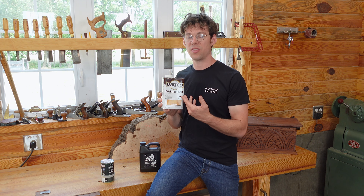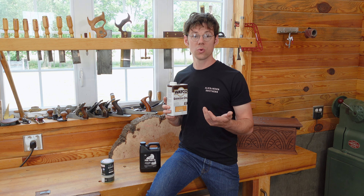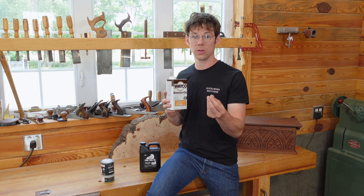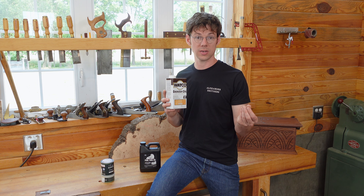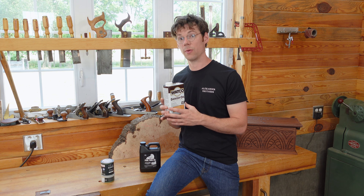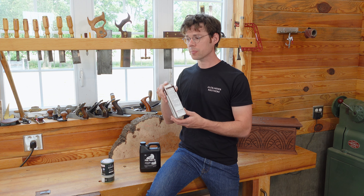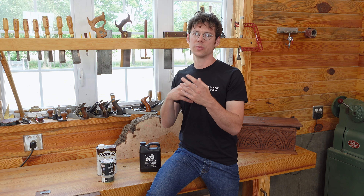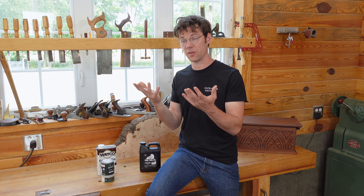Other popular ones may have things like a urethane varnish mixed in. Old school guys would actually take pure urethane varnish, pure linseed oil, and a thinner like pure spirits turpentine and mix their own what they'd call an oil varnish — like this product here. The varnish and the chemical help the polymerizing oil harden faster, and the varnish is somewhat of a film finish, so you can build up a finish faster.